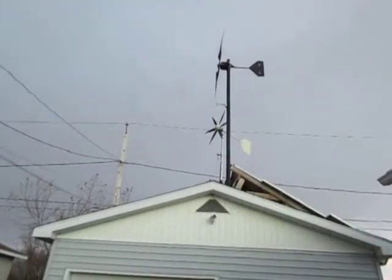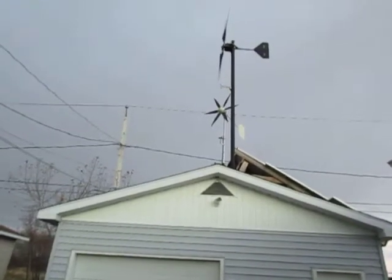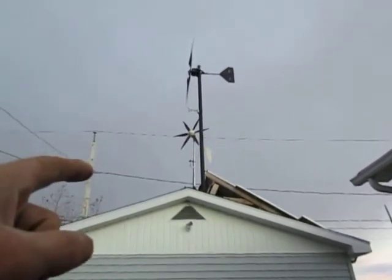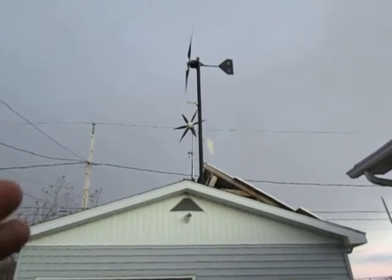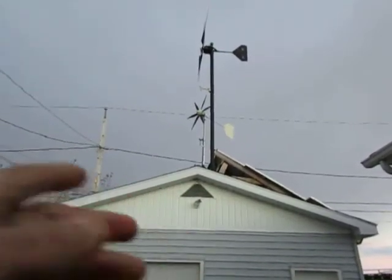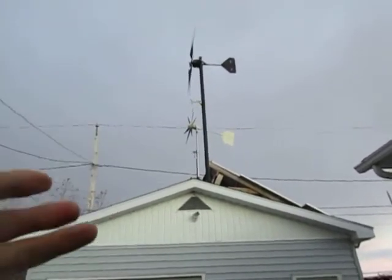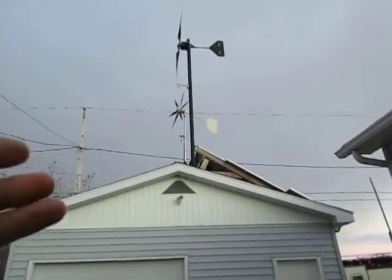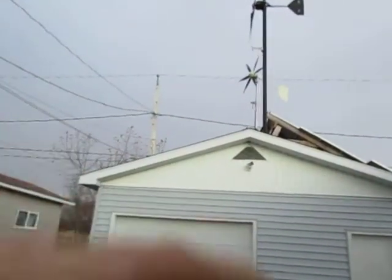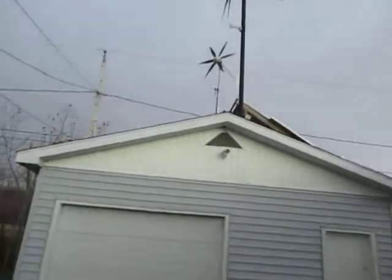The other one is it's tracking so great, and when I have big turbulence, there's another issue with that. When the turbine tracks too lightly and tries to chase the wind like that, it loses the momentum, you know. So that's a good thing in a sense, because you're always sure that your turbine is pointing to the wind, but it loses momentum when it tries to track the wind like that, and the blades are losing their momentum, and you lose power anyway.